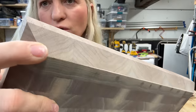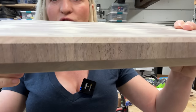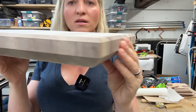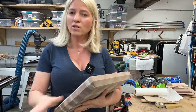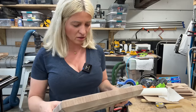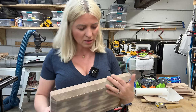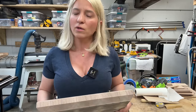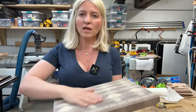Now I have a tiny chamfer on the top, and I think that looks amazing. Now it's time to sand it. I already ran it through the drum sander from 80 all the way to 180. Now I'm going to sand the sides where we put the chamfers all the way to 220 — I'll start with 120 and go through every grit. For the top, I'll just do 220.